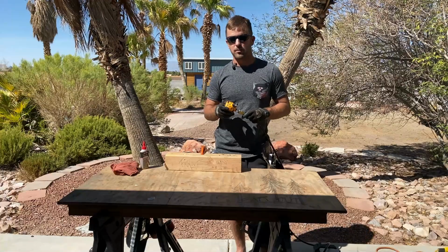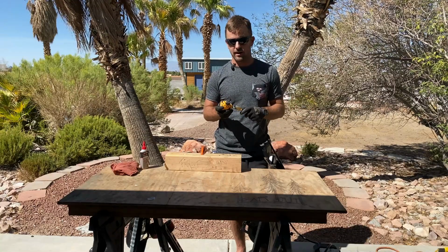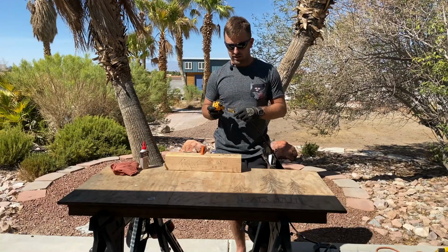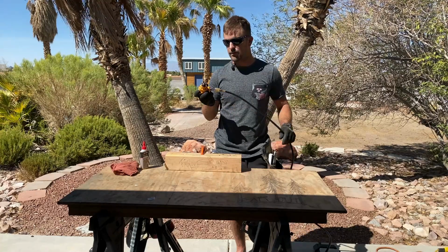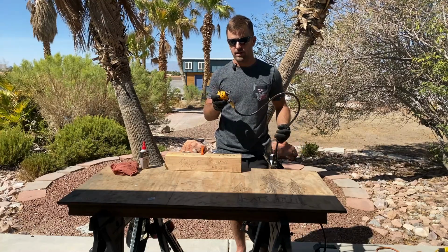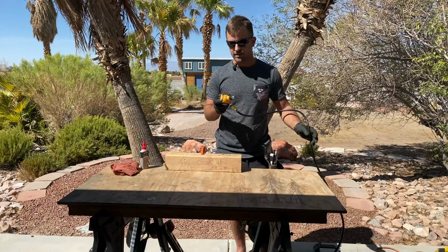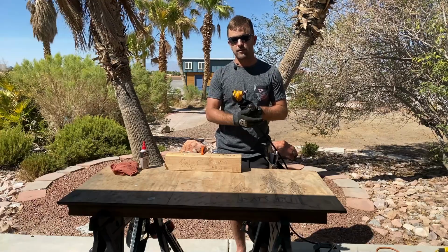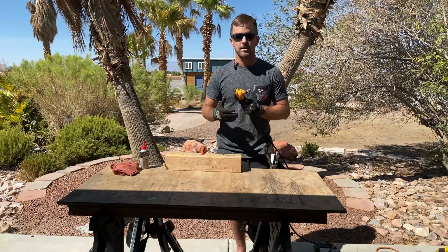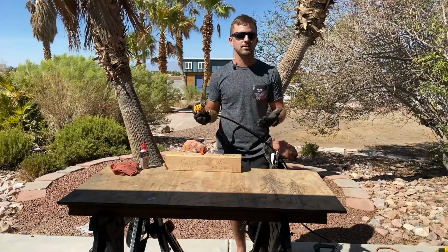So right now I have the pump off and we're just operating on the stored air inside the tank. What you've seen so far is about 5 or 6 nails. You can expect that if you're operating at a 70 PSI rating on your pressure valve itself, you get about 10 nails before the 150 pump needs to go off again. Just make sure you size your tank appropriate for the tools that you're going to be using.